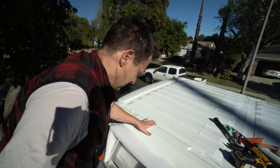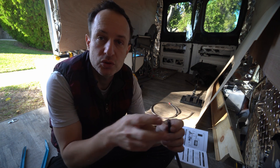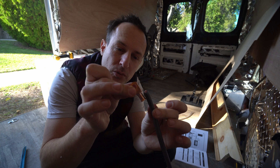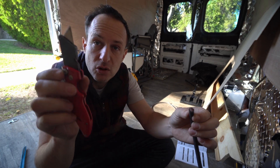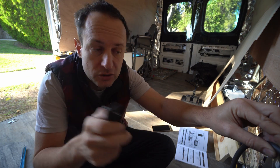Up on top, get pure copper terminals — definitely don't want anything with aluminum. You want to use proper tools for all of this. Do as I say, not as I do. Take off this much of the terminal so it can go in all the way. The outer jacket of the wire is the insulation — cut that all the way around, roll it. I don't want to do any kind of slicing of the little strands.